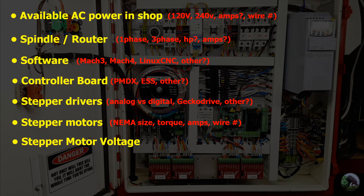Next, you have to decide what voltage you're going to run your stepper motors at. Your stepper motors will come with a spec sheet giving a maximum voltage, but it's an engineering decision. I'll link to a good article on Gecko Drive that covers this topic in depth. The summary is that you're trying to balance torque, speed, and heat generation of the motor itself. For example, if I have a motor that can take 80 volts, I don't necessarily want to run it at 80 volts — it'll give high speed but will likely push the motor's limits and generate a lot of heat. It's something you need to decide up front.